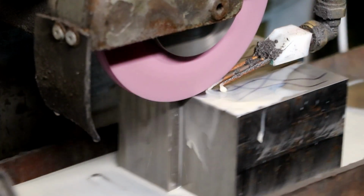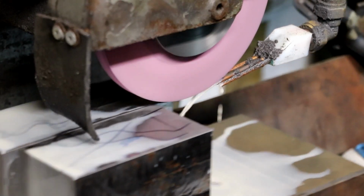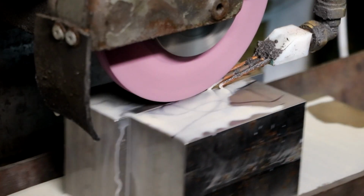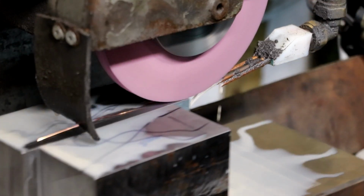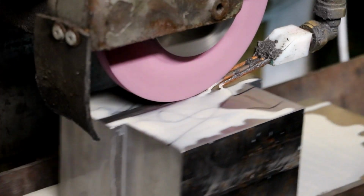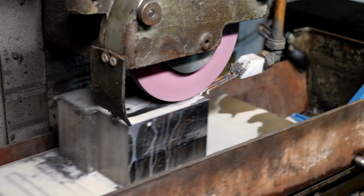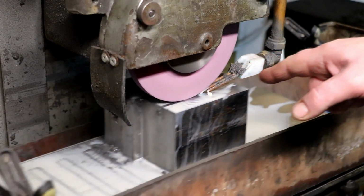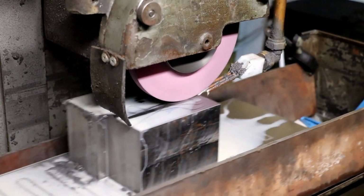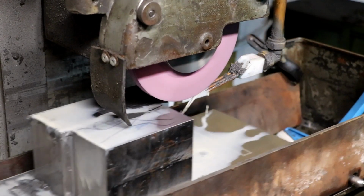Height wise it's turned out okay, because I didn't mill them both in parallel, did I? I think I'd measured them with a micrometer, didn't I? Touching the back one a bit now, look. Right, we'll carry on and then see where we get to, shall we? I'm about 2 thou down, and I'm just starting to catch this block here. So I'm maybe going to need another couple of thou to clean them all up, I think. It's missing that back edge.